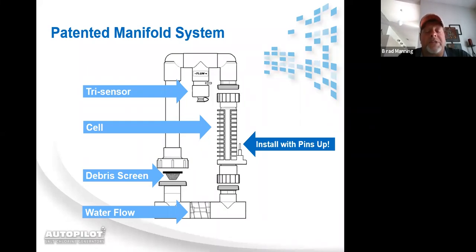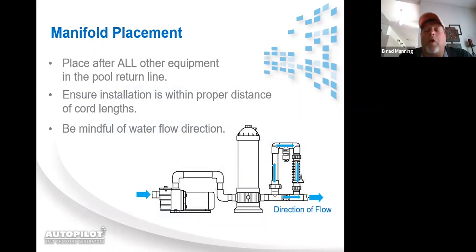If you place it upside down, the cell cord is going to plug up onto those prongs, and then when it rains, the water from the rain is going to run into the cell cord and could cause the cell cord to corrode. So when you have the cell cord properly plugging down onto the prongs, the cell cord acts like an umbrella, and you don't have to worry about getting the connectors inside the cell cord wet and causing corrosion.